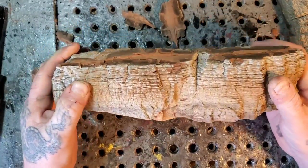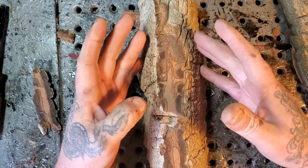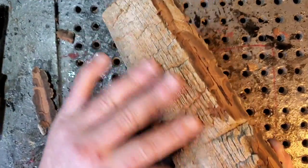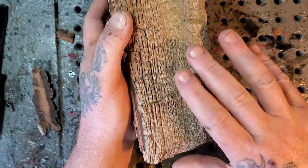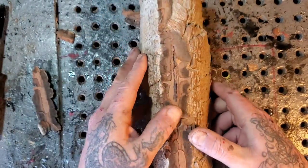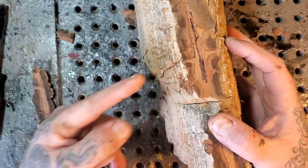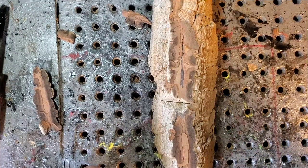Now I think I can start carving. Let's do a wood spirit right here - just a simple one. I'm going to do one more thing before I start drawing: clean up the outside of this. When you carve this bark you want to leave some of the natural weathered gray outside bark. I'll clean up right where I want to carve the face deep. You can see these cracks - if they go straight through, there's a good chance they go right through the piece.